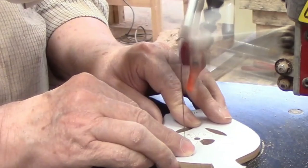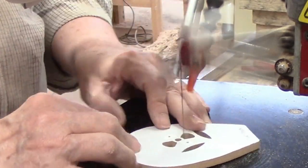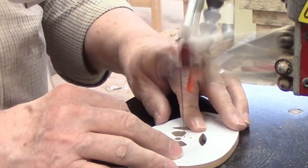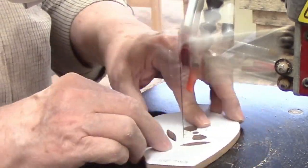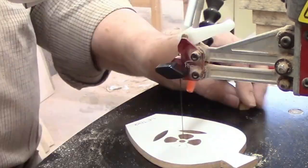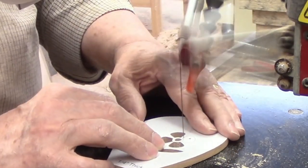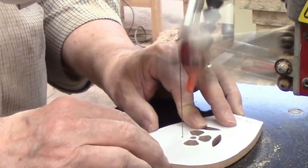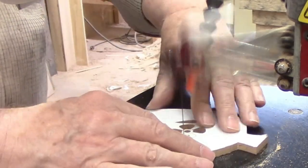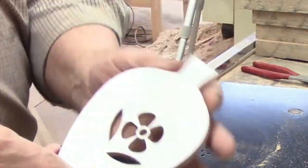One place I could have worked smarter would have been to use a larger drill bit to make the center hole for the flower. I used the same bit for the pilot holes so I had to cut the circle with the scroll saw — it would have been more efficient to choose a drill bit large enough to drill the center hole rather than cut it out. Once I made all the cuts I pulled off the pattern. The tape holds well while I'm cutting but peels off easily and leaves no residue when I'm done. I'll leave a link to my supplier in the description.